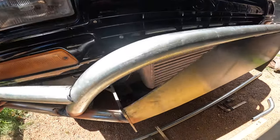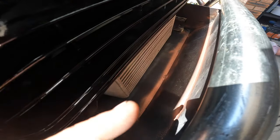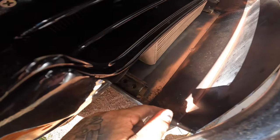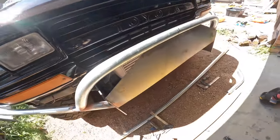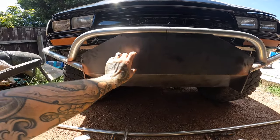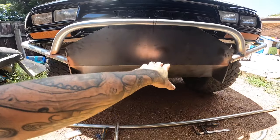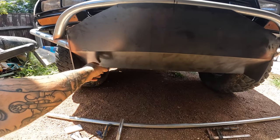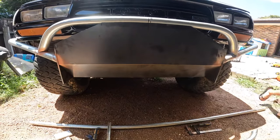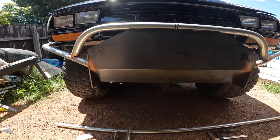All we've got to do in here — I went and got my plate this morning. I'm going to put a plate from the chassis out, cut around the shape of the intercooler onto the other side, one bolt in each plus weld it fully to this, and that's where the winch will sit on. The number plate fits perfectly here, and I'll work out my winch exit — that fold there should be pretty close to the top of the chassis line, so my winch exit will be there. I'll drill some holes for airflow up into the intercooler.